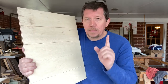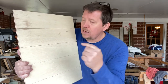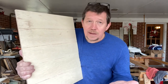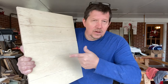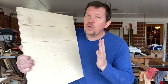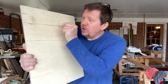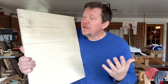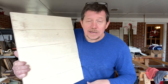It's gonna be really hard to do with a brush and obviously impossible with a roller, so you probably want to come up with some way to spray it. We have just a little electric sprayer that we use. You could use canned spray paint, although I'm not a fan of that. You could go back with a little detail brush and get in there to fill it in, but it would be really tedious. My suggestion would be to get an inexpensive little sprayer, go to town, and take about two minutes. So that's it.